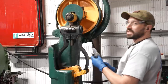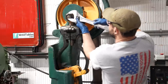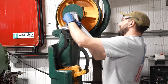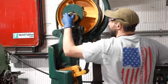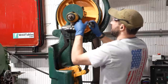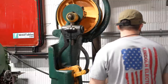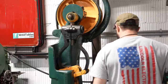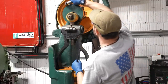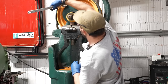Coming up to the top adjustment, I learned by accident that if you loosen this nut the whole thing is able to move. There's a post in here with a T-nut spacer that blocks it from getting pinched, but by tightening this nut you're essentially tightening the travel against this disc here. I don't know all the proper terms but if I turn this I'm going to get travel up or down from the whole ram.